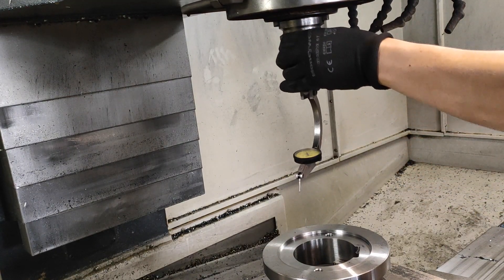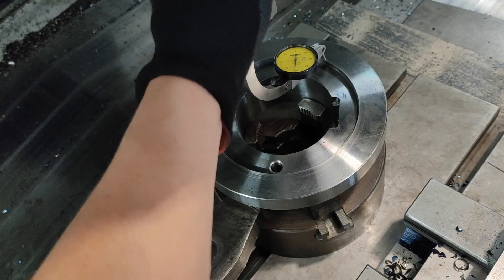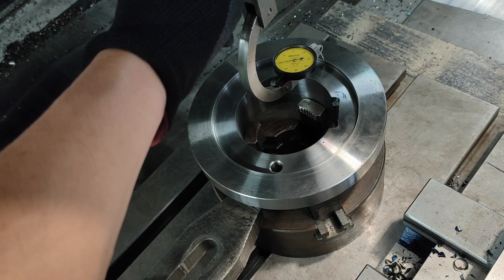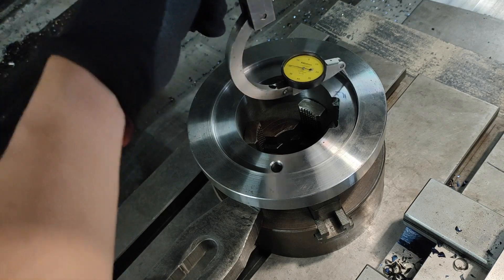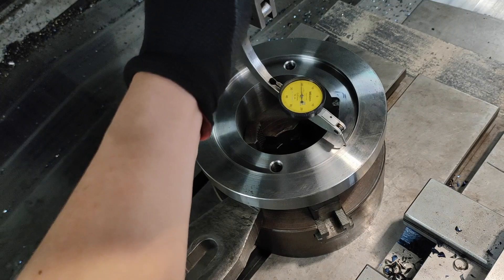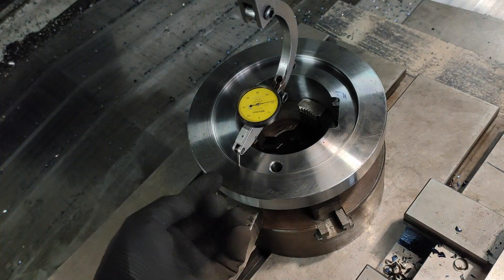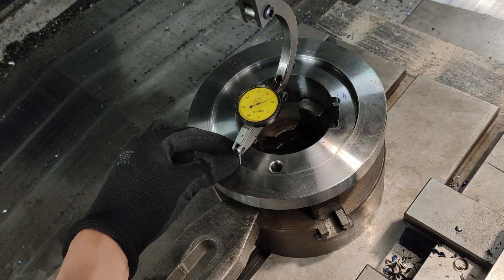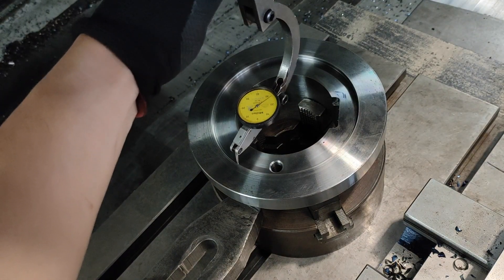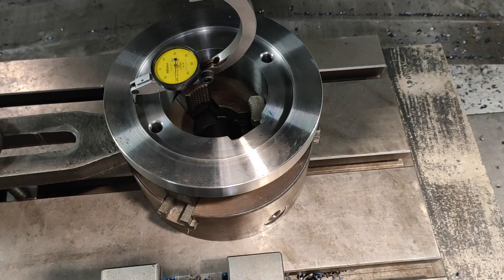Put it in the spindle and I'm going to move my Z axis. Make sure your dial is almost equal distance from the inside of the bore — make sure they are at the same distance or gap, like this, and also on the Y axis. I will move my Z down below the inside diameter and get the lowest point of the bore, then set it to zero.